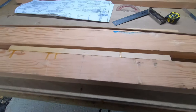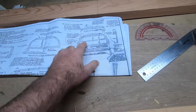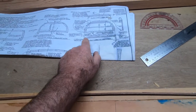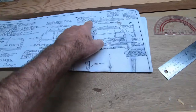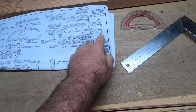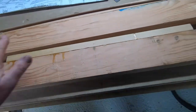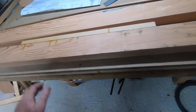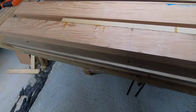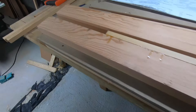We're building the barrel back part, which is on the transom. This is the bit I'm starting with, and it bows out by four and a quarter inches, which is 108 millimeters on the plan view. This gives it the nice curve so the round barrel back will come out and curve, and then this will be covered in plywood — I'd imagine three layers of the three-mil stuff.